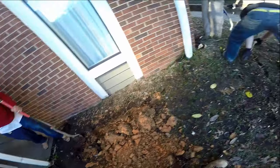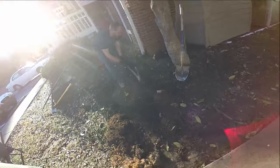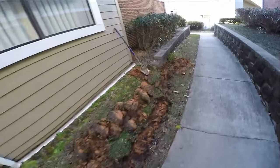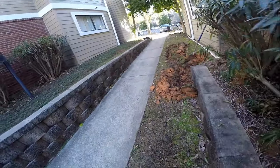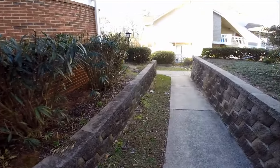So we need to dig a trench. It comes around — we've got some heavy tree roots, real heavy trees — and comes through these roots, over here by the sidewalk, then comes down. We'll discharge the line here so that it has some fall, has gravity. We have to get that water to flow away from that area. Once it gets out here it can just easily run down — there's a storm drain at the other end.